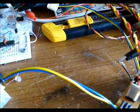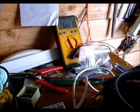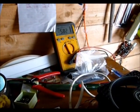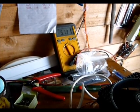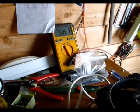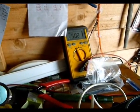This is how you set it up - you just get a little screwdriver, and once you've got your fans running nice and slow at the slow speed setting, you then just dial it clockwise until it goes down to the speed that you want. I haven't got an RPM readout here so I'm just going to dial it down to five volts, which is roughly where fans will start spinning.